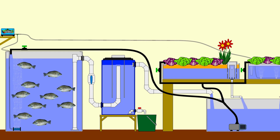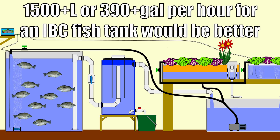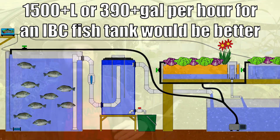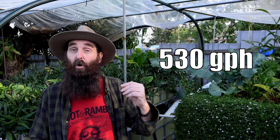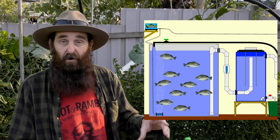Following the first loop, water is pumped up into the fish tank where the accepted rule of thumb is to have an incoming flow rate equal to the fish tank volume per hour. Personally I prefer more — in our system we run around two thousand litres an hour, or double the tank volume every hour. Into the fish tank we also have an airline to add movement and dissolve oxygen into the water. The rule of thumb is at least the tank volume in air every hour — at least a thousand litres or 260 gallons of air per hour to keep the fish happy.